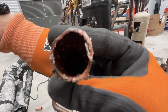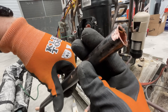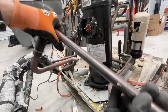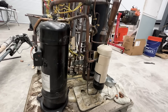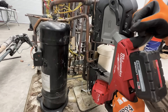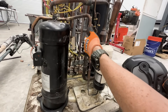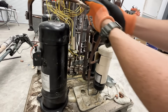It's not looking good. Showing the inside of this pipe — the maliciousness of this sawzall is a little intense. So far we've got contamination, but the question is how much contamination do we actually have? Let's blow this out with RX11 onto a white napkin to see the full extent. Next up we need to cut the liquid line with the bandsaw. I would cut it here, but it's not exactly user-friendly, so we'll have to do some bending to get it out of the way.